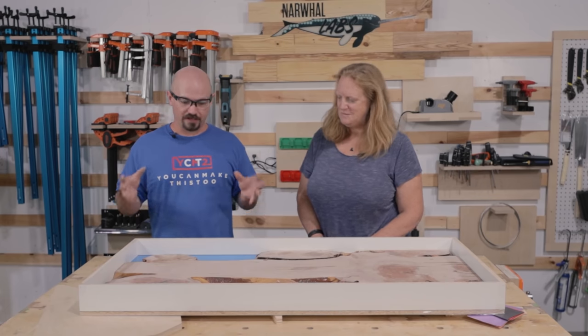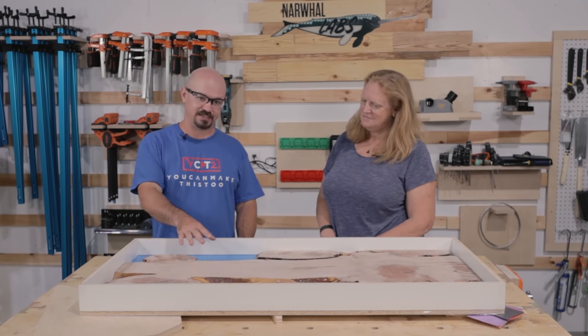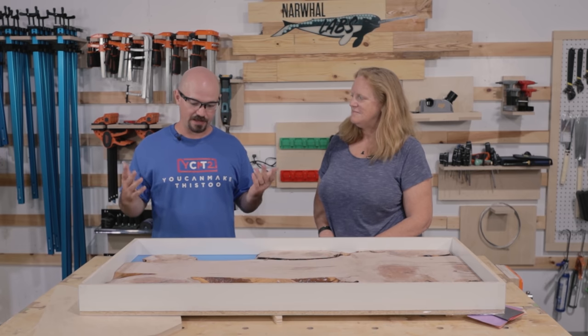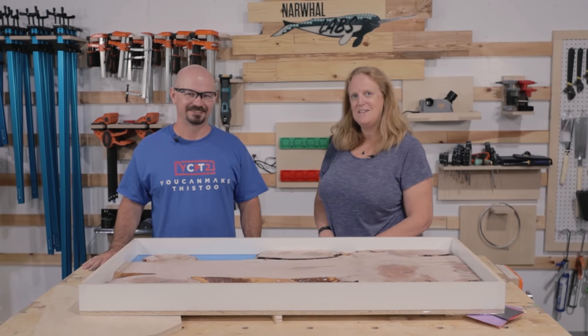So it's early in the morning. We got the first pour done. The goal is hopefully at 5/8 of an inch thick. This is thick enough that before we wrap up for the day, we can do the second lift. So that way tomorrow it can cure and give us time to then demold it the following day and start finishing it. The race is on. The race is on. All right. Thanks for coming. We're psyched to have you and let's keep going.